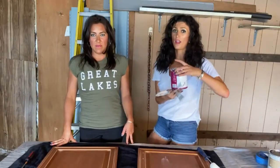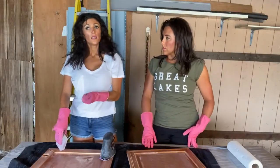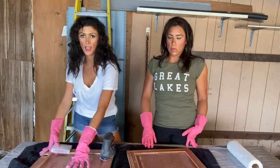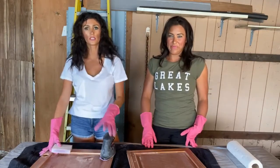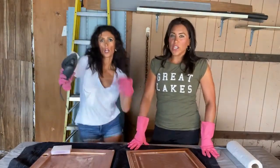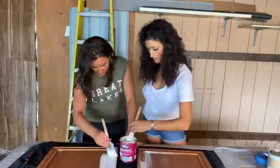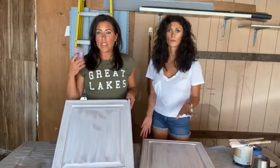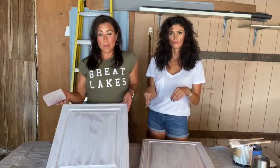Now prime the piece. A lot of paint comes with paint and primer in one, and it's possible to just paint over whatever you have. But taking the extra steps ensures a really smooth, clean finish. Since it's going in a bathroom, you need to account for moisture, hairspray, and perfume. Once the primer is dry, take that light sandpaper and run over the piece one more time to make sure there aren't any clumps, chunks, lumps, or bumps.